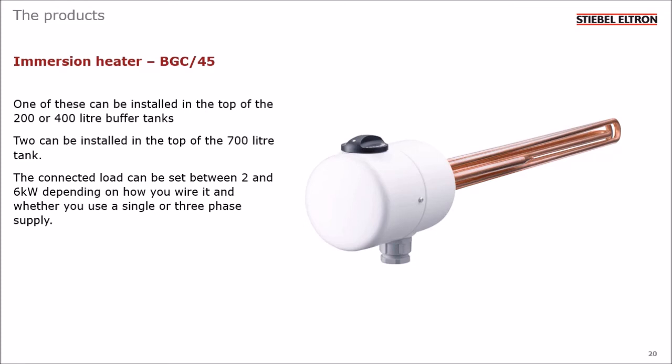The 200, 400 and 700 litre buffer tanks have a 1.5 inch female threaded port that's used to connect the BGC element. One thing to be aware of is that the heat pump controller is not capable of switching this element directly. The element draws too much power for the small relays inside the heat pump controller. So the installer has to supply and fit a contactor or relay that is capable of switching the connected load.